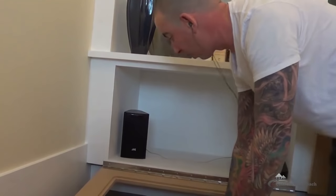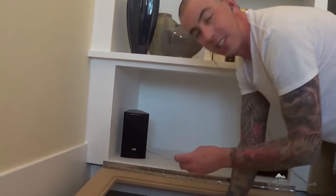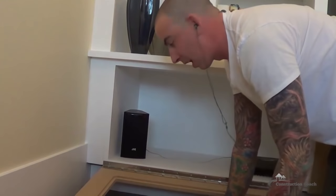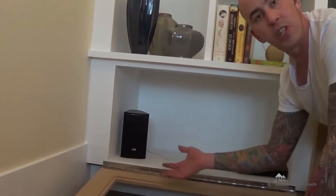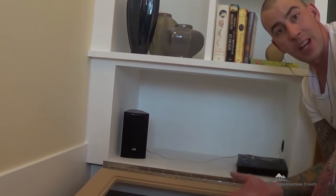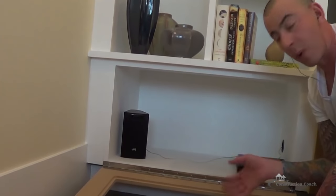So throughout this install, I started by using the center punch to lightly push the holes. I found it hard to find the exact hole to re-hit it down. Since then, I've adapted to using a pencil, marking the exact circle, then bringing my center punch in and punching the hole. With hardware and anything that you're fastening, like hinges or latches or anything like that, it's just trial and error to find out which works best for the procedure that you're doing at that time. So just whatever works for you, based off the same principles for marking and all that kind of stuff.